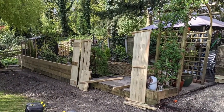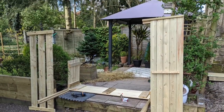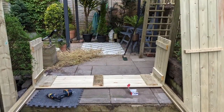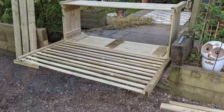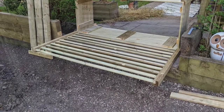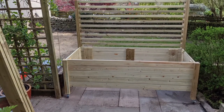I didn't video the assembly process in the client's garden, but assembly was fairly straightforward. Once I'd constructed the main planter itself, I fitted some locking casters that she had supplied, plus added some spare stock that I'd brought as extra support under the base, given the weight of the soil that would go into it. I then lined it with thick black plastic using wide head clout nails. I made sure to attach it fairly loosely to allow room for it to settle once the soil was added.